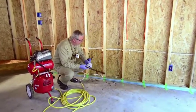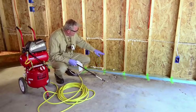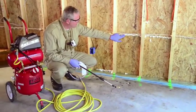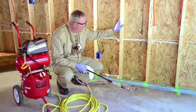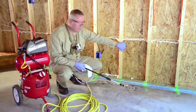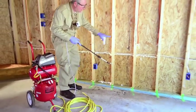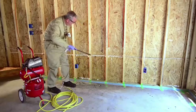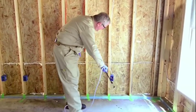What we're going to be doing is treating from two to eight inches out with the Boracare onto the concrete itself, and we want to come up a couple of feet on the walls and on the studding. We have the unit on fan spray, so what we'll do is just come and fan this zone and move down the wall itself, fanning the material onto the wood, taking care to cover both sides. Get behind that electrical box and keep moving down the wall area, getting into those little pockets.